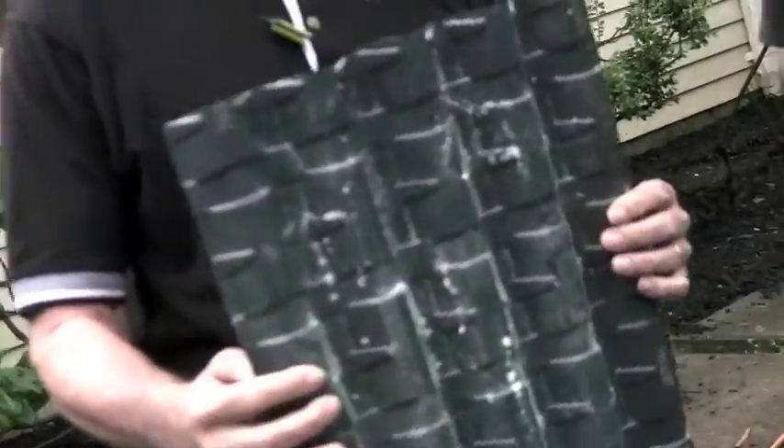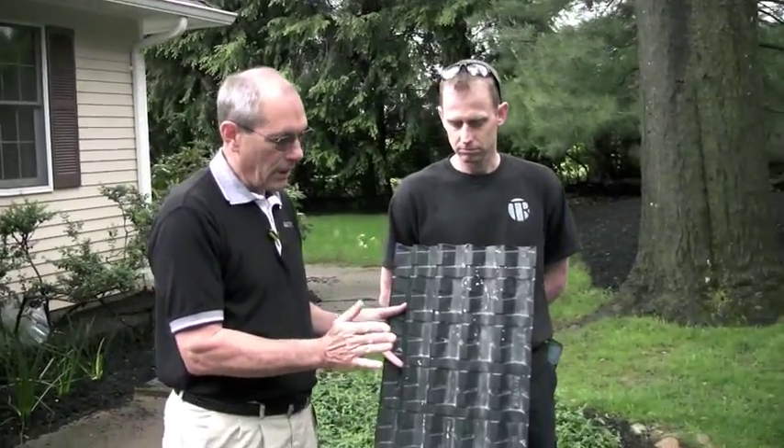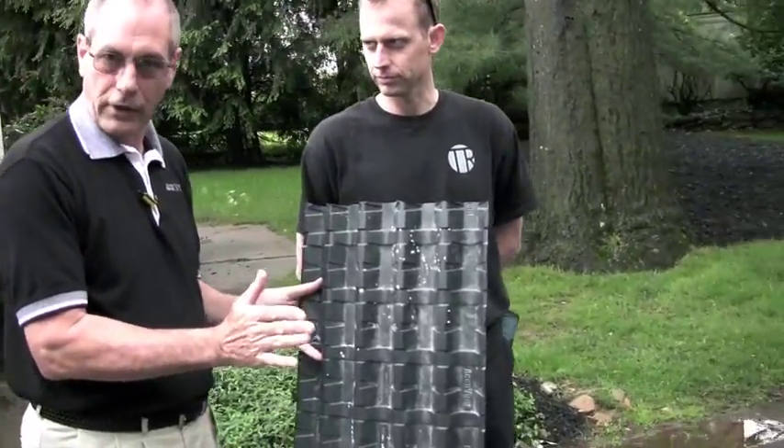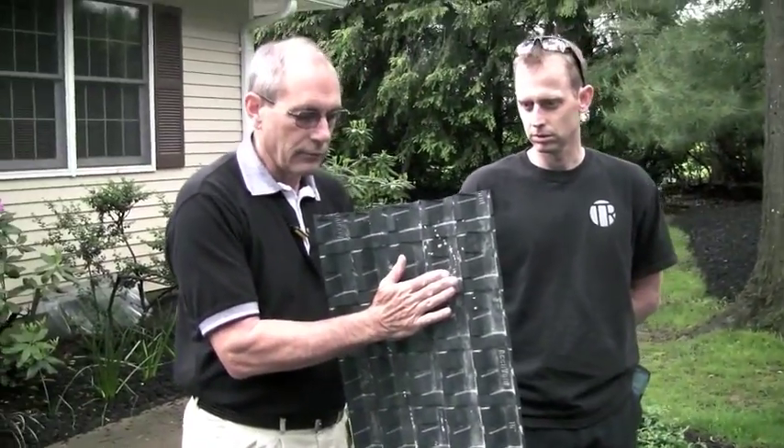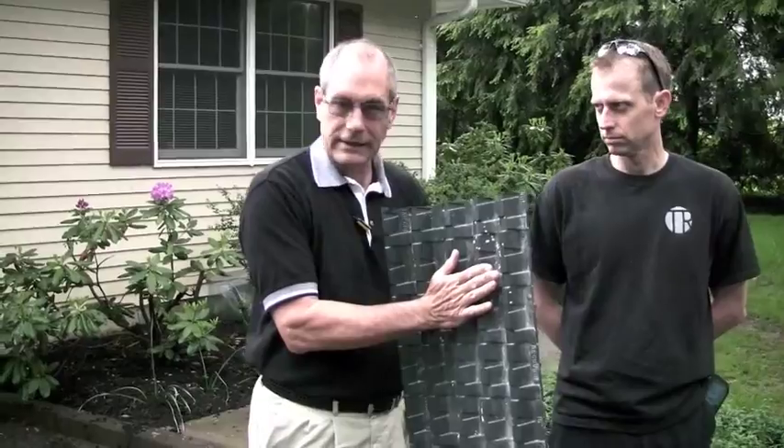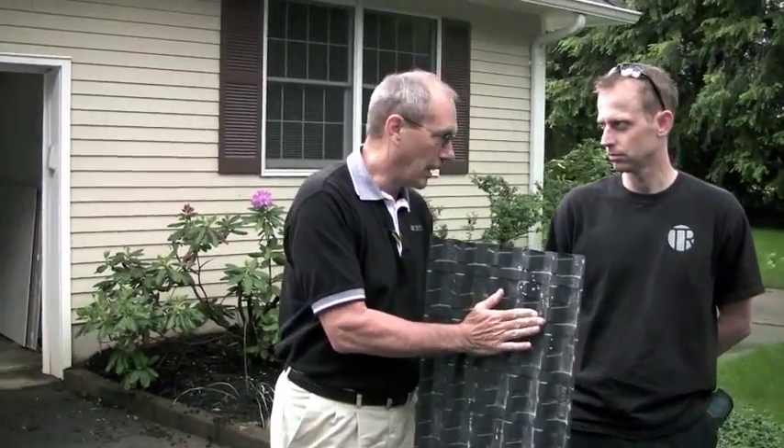The challenge, for many inspectors, many builders, and some knowledgeable homeowners, is to maintain ventilation between the roof decking and the layer of insulation. In this case, we're using National Fiber Cellulose, and dense packing simply means that the fiber is packed tightly against our product.